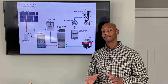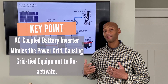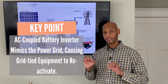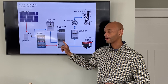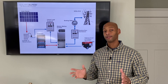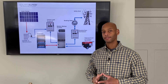What that does is it tricks your grid-tie inverter system into thinking that it is the power grid. As long as it sees voltage and a good stable signal there, your grid-tie solar system doesn't know whether that signal is coming from the battery inverter or from the utility grid itself. All it knows is that the connection is back up, which means it can reactivate and continue to supply power into the system.